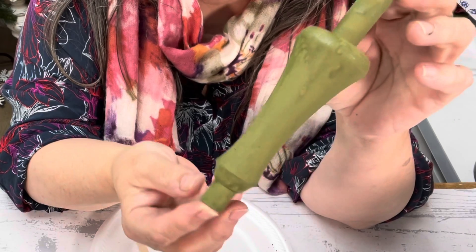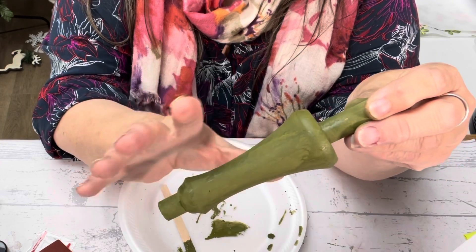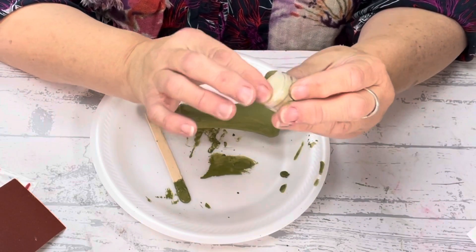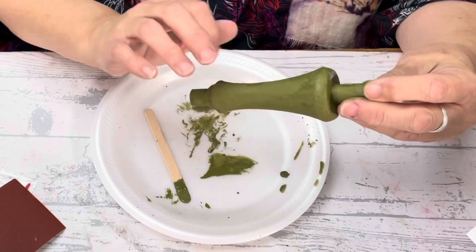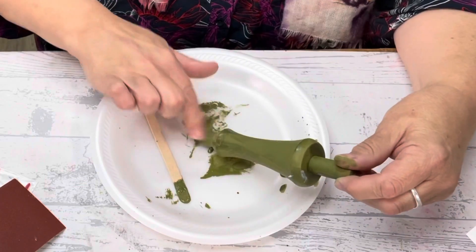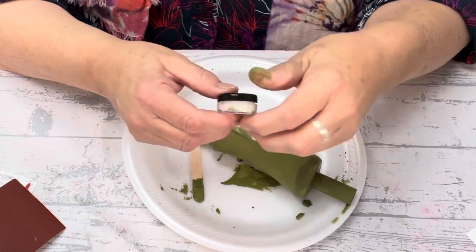We've got one coat of this pretty, very pretty green. I actually put it on pretty thick and I think this might chip here — I kind of want it to chip, it's kind of the look we're going for. So we can take some of this wax, and this is one way of getting your items to chip. You can put some wax on it, just sort of be random with the wax. The idea is when we put our second coat on top, the wax is going to work as a resist. We're going to keep this for later because this is what we're going to finish it off with.